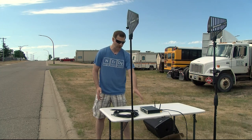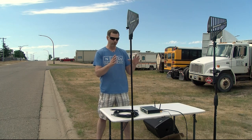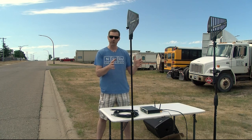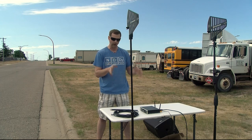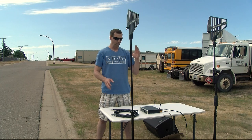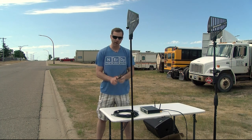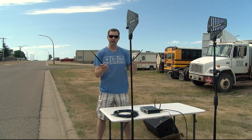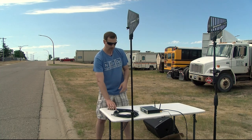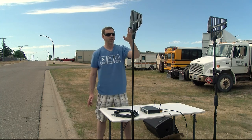What we've got here is one of the brand new Sennheiser EWD wireless systems, and we're going to use this with a body pack, because those tend to be the worst — handhelds are always better since you hold them up high. We'll start with these quarter-wave monopole antennas, measure until that drops out, then switch to these half-wave dipole antennas, and then when that drops out, switch to the new LPA log-periodic antennas that Sennheiser has come out with for the EWD.